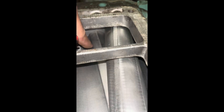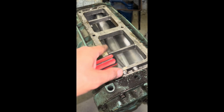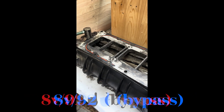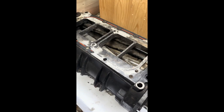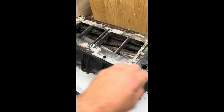I'll just show you — there's no outlet on this side either, no outlet on the top, no bypass. So these two here — that's a V92, this is an 8V71 — true non-bypass style blowers ready to be converted over. Same case with this one that I just scored, actually five minutes from where I live — that's an 8V92 and it's got the big bearing plates that are wider, that are ribbed, with bigger diameter bearings.